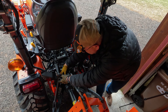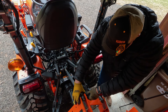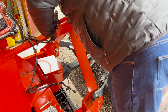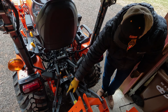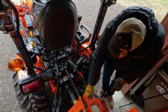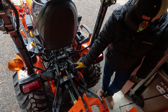That's done. I've got another safety chain here — let's get that off. Pretty much we've got all the three-point connections off. We can let that go down, pull out the other pin, and then pull out the other side. We're going to need to lift that arm and start the blower to get her going. Let me get in a better position to take off the mount off the shaft, then we'll loosen that side off so we can move the tractor forward and get the three-point off.